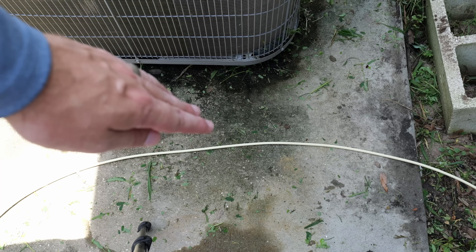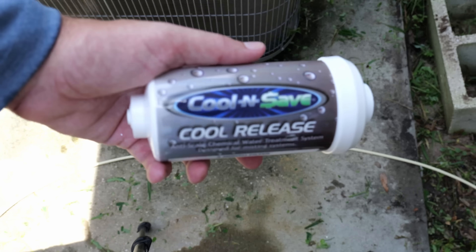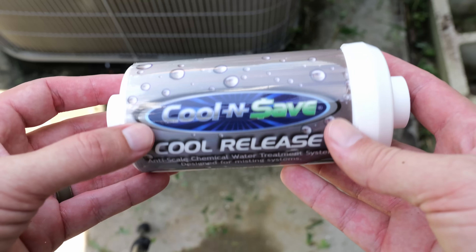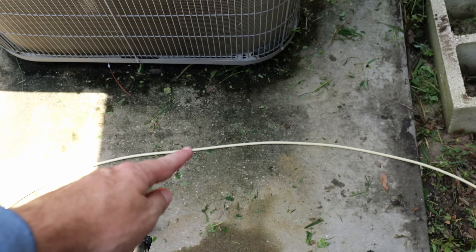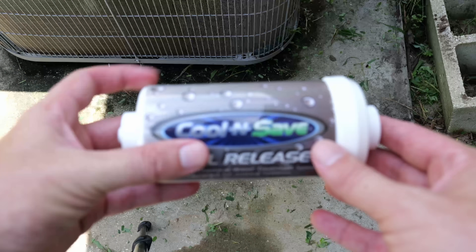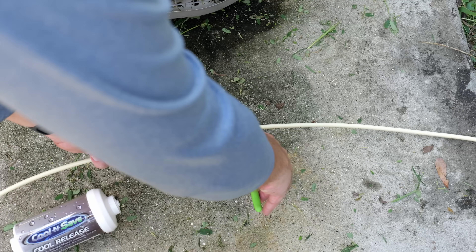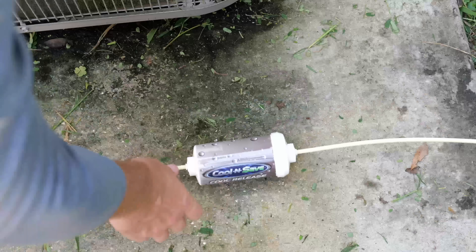Now that the main line is connected to the hose bib, I need to make a cut somewhere between the hose bib and the AC unit to install the filter. The filter can lay on the ground — that's actually preferred — but don't cut your main line so close to either end that the weight of the filter would be hanging on it. We don't want any strain on the inputs. I'm cutting mine in the middle so the filter can just lay on the ground, using side cuts, then inserting each side of the supply line back into the filter.